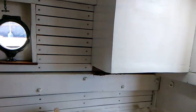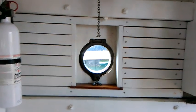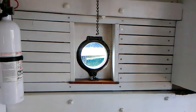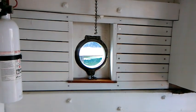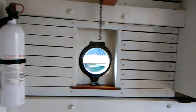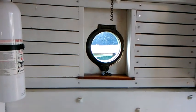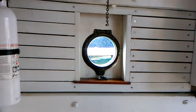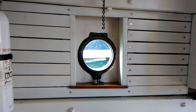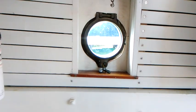I did however still have a major leak and it turned out to be associated with this port light. About a week ago we had another big rainstorm and quite a bit of water leaked in and I couldn't see where it was coming from. But being on board during the rain event I was able to discover exactly what was going on — it was this port light. With the port light dogged down it was dripping at a very steady rate, not just an occasional drip but drip drip drip drip like that as wind blew rain up against the outside of the port. I dogged it down as tight as I could; I even used a pair of pliers to dog it down completely and that didn't stop the leak.